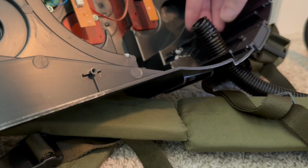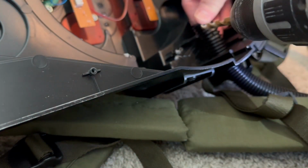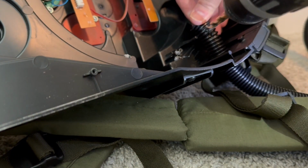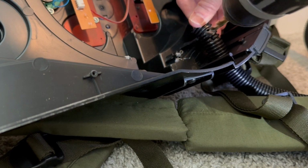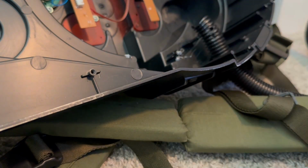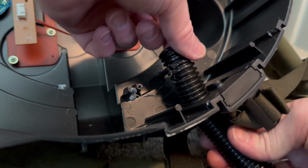Okay, so now I've drilled this hole on both sides. That gives me a place for the screw to go through and grab on the top, but a little bit of a pilot hole in the bottom. And then I am going to switch to a bigger, and this is a 5/16 inch bit, and I'm going to drill a much larger hole in the bottom there. Just be careful because this stuff just kind of shreds up a little bit. There you go. All right, not perfect, but it doesn't really need to be perfect. It just has to hold into the peg.